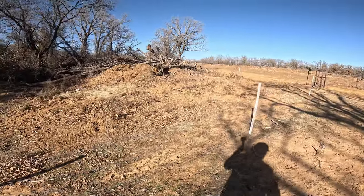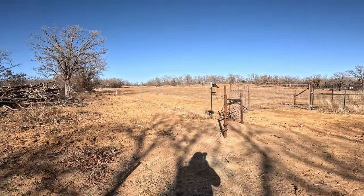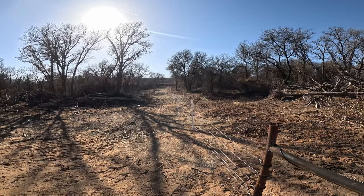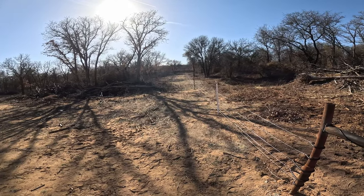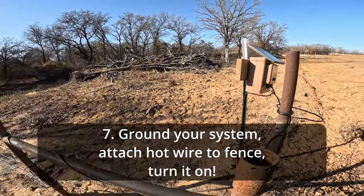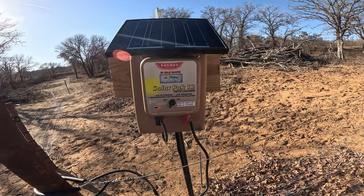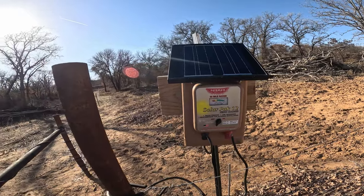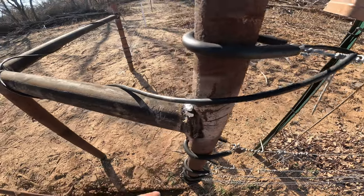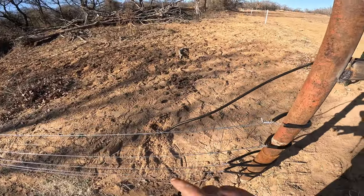It makes more adjustments and it's running off the same charger as the other one. From start to finish we started about 10 o'clock this morning and it's about 3:30 now, so it took us about five and a half hours to get about 300 feet done, but we were kind of relearning as we were going. The more fence like this we build, the faster we'll get at it. This is just a little Parmak — I might end up taking this charger off and putting one of my Cyclops chargers on. I like Cyclops a lot better than this one. This one's battery has already gone bad once since I've had it — I've had it about two years — and that battery ran me almost as much as the Cyclops charger does. All I did was run this little tie wire in some insulation and wrapped it around the pole and it's going all the way over here making this side hot. I might put a switch in here at some point so I can turn this off if I need to.